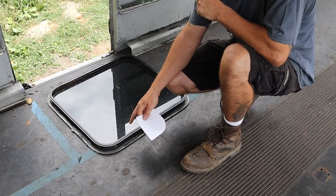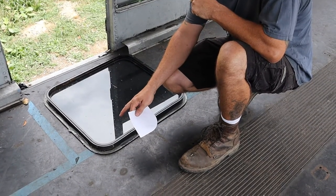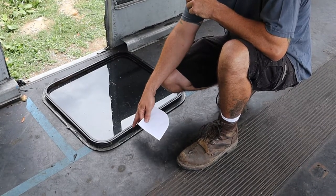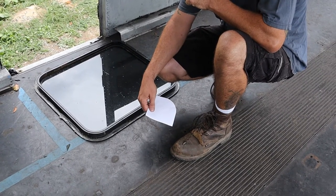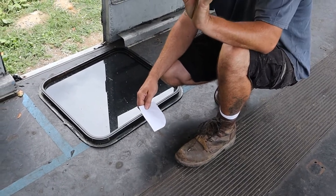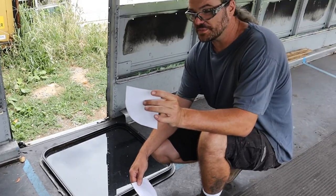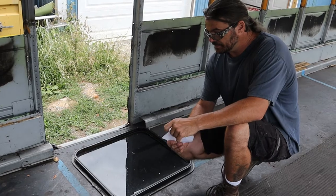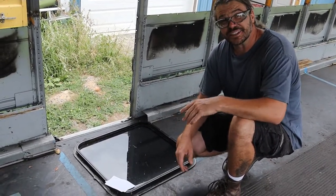So if it's a 3-inch, we want to come inside of it a little bit. We want to leave an 1/8 inch. So then we're going to pull it back that way. Putting the window in, it'll actually slide in over this lip and fit. But get it right. We're going to take a pause on this because we got to order these. I'm not going to cut these. We're going to get these cut out at a local metal shop out of 1/4-inch plate. We're going to turn our attention to the door, so get fabricating the door.